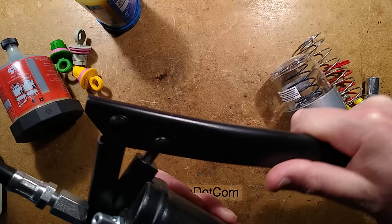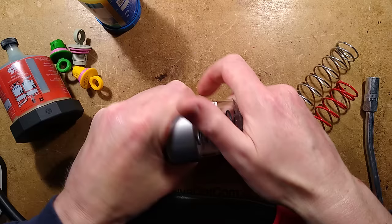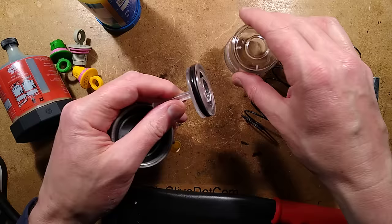The first level of automation is this very simple spring-loaded one. The spring-loaded one has a chamber with a programmable grease dispensing speed set by the viscosity of the grease and the spring you use. Inside is a plunger that rides up and down, pushed down by a spring with a large O-ring in the side.